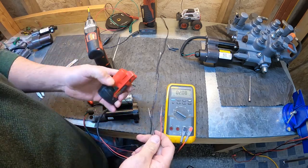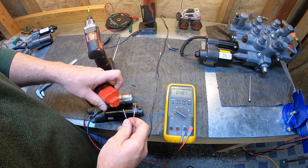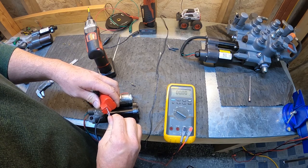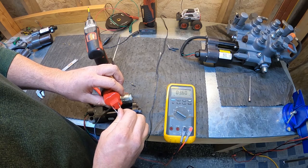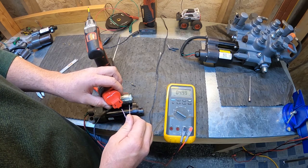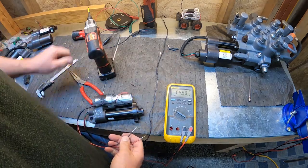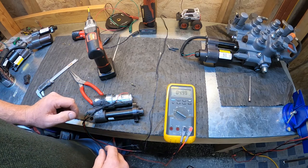And now without a servo driver, which is running a 12-volt battery, 4.8 volts. Just verify this. So we deadhead it all the way down. That's zero. And then it might roll over here. If we go all the way out, it does roll over. But it bounced back a little bit to 5 volts. So no worries. Okay, so that's how we calibrate first generation actuators.